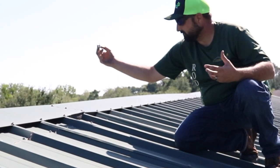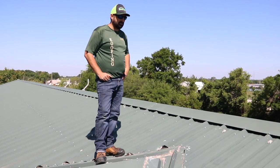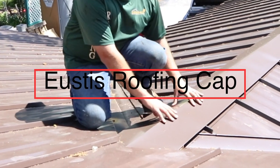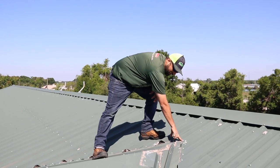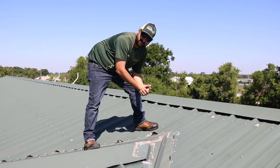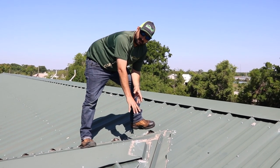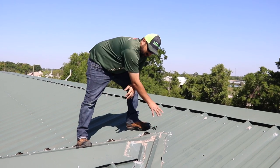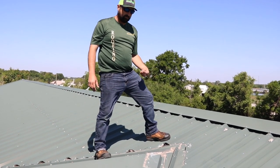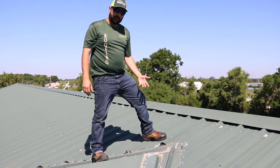We've got a major roof problem here. This is something you don't want to see when you're spending hundreds of thousands of dollars on a metal roof. This is a big transition — you've got a valley, a cap, and your panels. Earlier on a better roof, the cap came through here and underneath the panel, which protects you from the seams where valleys come together. What's interesting here is we're back to customization — this piece is built for the rake of the building, it's not built to be a cap, and this is what you get when you don't customize a metal roof. All this water is going into this area and sealant is the only thing that has prevented major issues — and it already does have problems. Sealants are not what you want protecting your investment.